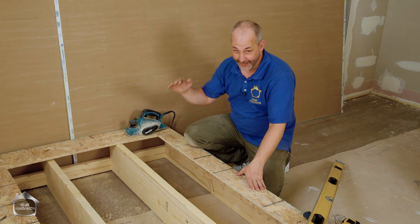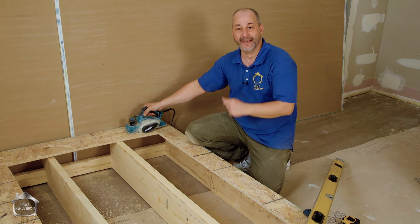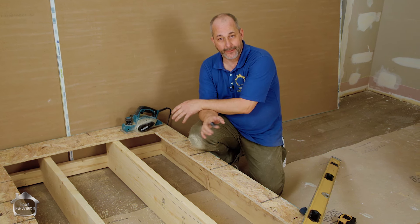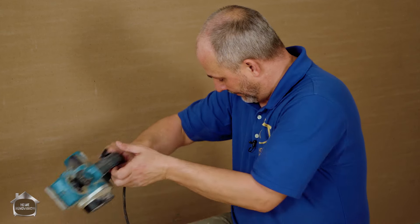That's how you deal with a hump - there are no other options. If you want to get rid of a hump and you don't have a planer, you could use a belt sander or orbital sander with 36 or 50 grit - be prepared to invest about an hour but you can get it done.